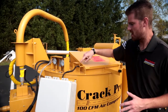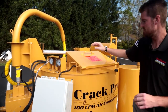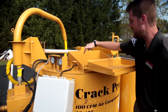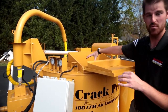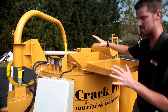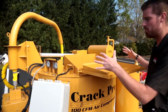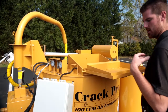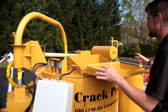We also wanted to touch on our limit switch for stopping the agitation. When I open my loading door, I have disengaged my loading switch and my agitation has completely shut down. This is to reduce any splatter — remember we've got 350 to 400 degree material in there and we are trying to reduce as much splatter as we can. We also wanted to mention the low profile design of this machine: my material load height is here a little lower than shoulder height, and with the low profile I have a full 360 degree view of my work area.